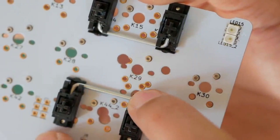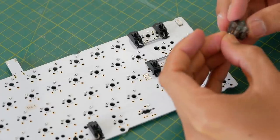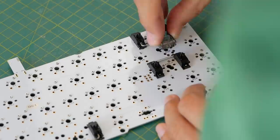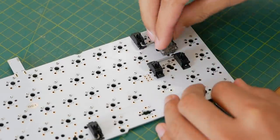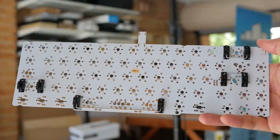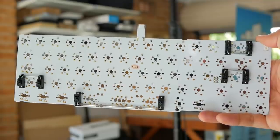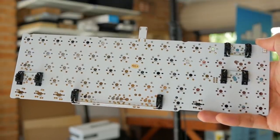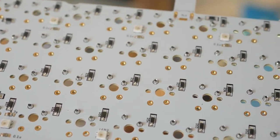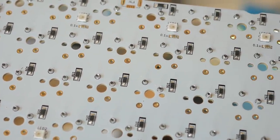You'll probably have a few spots where you can't place the socket in the PCB because of multiple layouts, so I just put the socket on the switch first and then put it in place to solder. And there, we've just turned this into a hotswappable PCB. It's pretty cool, but also a bit pricey. To fill up this board it cost me about 40 bucks AUD, so like 30 USD.